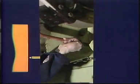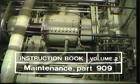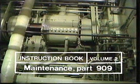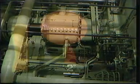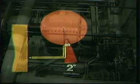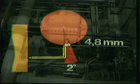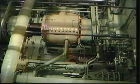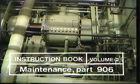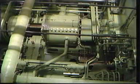If the change in camshaft adjustment does not exceed 2 degrees, it can be compensated for by adjusting the fuel pumps. This operation is described in Volume 2, Section 909 of the Instruction Manual. However, if the change exceeds 2 degrees, the camshaft must be adjusted to ensure correct timing of the engine. The change is measured with the help of the pin gauge. On the K90 engine, 2 degrees is equal to 4.8 millimeters. Adjustment instructions can be found in Volume 2, Section 906. After camshaft adjustment, the engine's maximum and mean effective pressures should be checked.